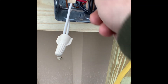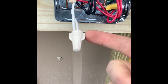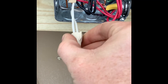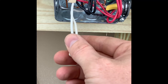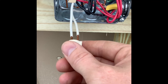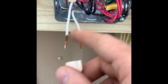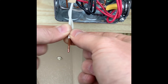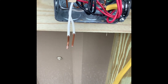However, the box I was working in on the job was containing joints made like this one — not pre-twisted. So me being a little sloppy and in a hurry, I just start twisting this thing off. I'm going to slow down here so you can see. As I start to remove this wire nut, you'll see that these wires start to come apart. And somehow, either them coming apart and smacking the side of my finger, it seemed to me that a wire popped out of this wire nut and tagged me right in the finger — it was probably a little shorter than the others. So as I was pulling this joint off, this one popped out and hit me in the finger, and I got 277 volts.